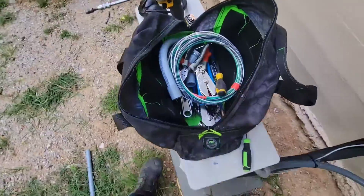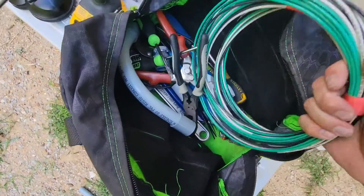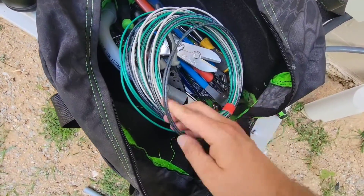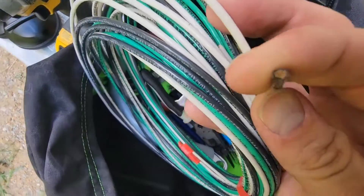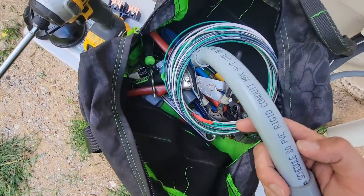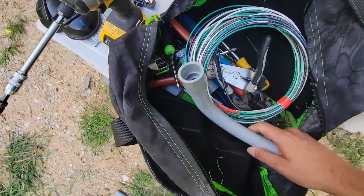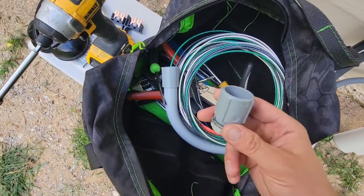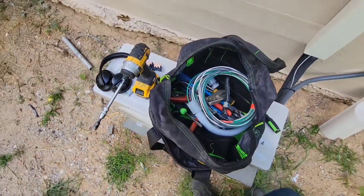This is the wiring that I'm using — stranded wire. I've got white, black, and green. You can see how that's stranded. Now I've got my conduit fittings — my sweep — and that says Schedule 80 PVC. And this right here is to connect to the box. Let's get started.